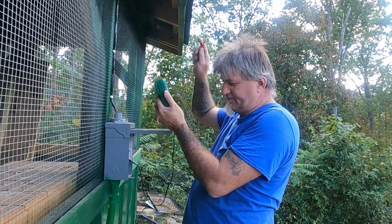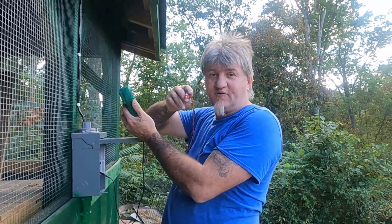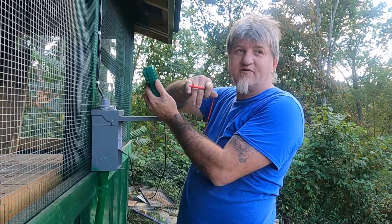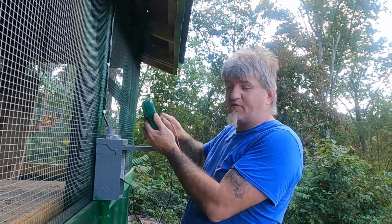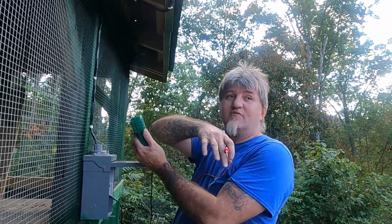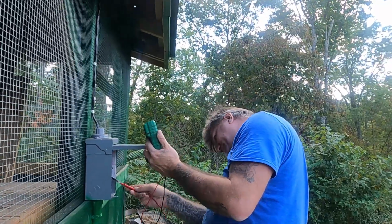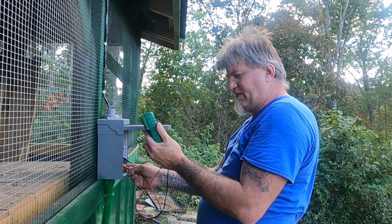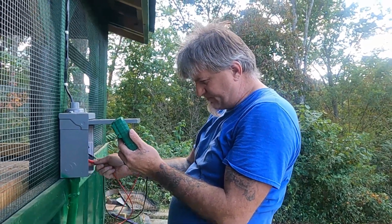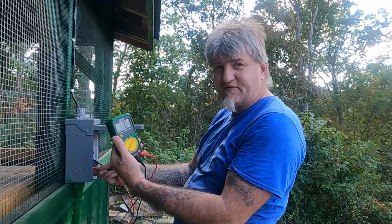Okay, with that being said, I went down there and killed the breaker outside of the GroWatt inverter. I've got a disconnect here and a disconnect right there inside the house, so it's kind of redundant. I can kill the power inside the house from the solar panels if I need to, here or the other. Then I killed that switch, thinking maybe the GroWatt was back feeding up here. It's not. Nothing, zero volts.